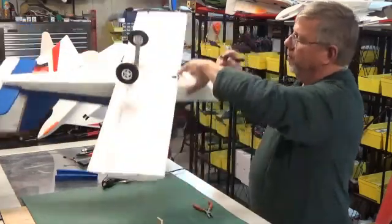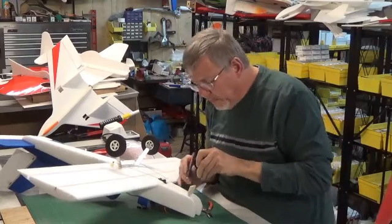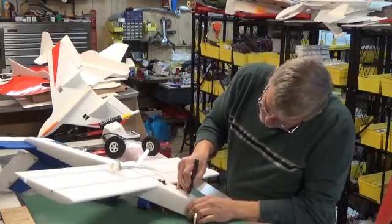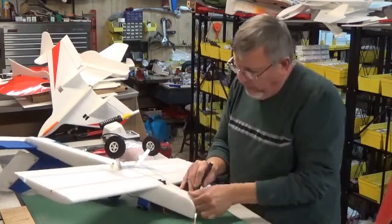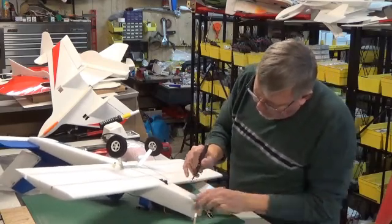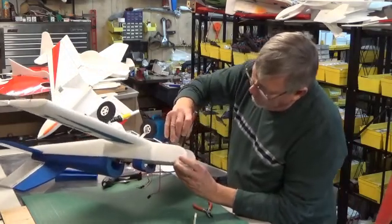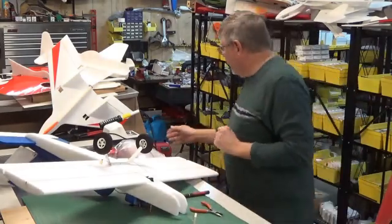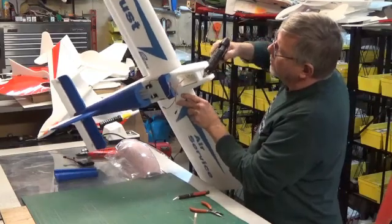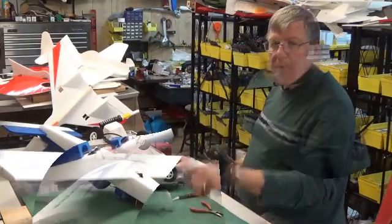and then I'm going to flip it over and cut the thickness of this out, which is about 3/16 of an inch, all the way across, and I'm going to peel it out of there and cut right down to where I cut that line across at the top. It's a pretty simple procedure. Clean it out so it's real nice. Then I'm going to fill that with hot glue. I'm going to go all the way across and down, and then I'm going to glue this piece in.